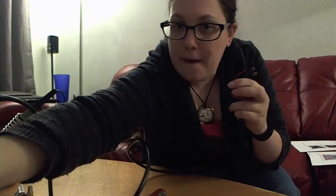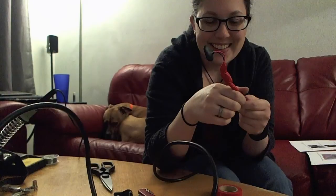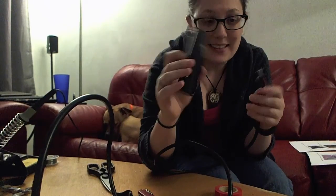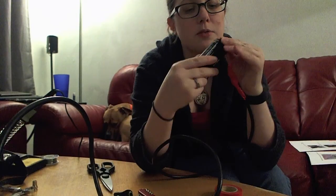Next you want to protect all of this exposed metal. If you've put a heat shrink wrap on, you would shrink that now. Because this RF choke is really big, I'd just use some electrical tape to go all around it. This big old mess here is your power connector. Your power supply is your 8 AA batteries in a battery case, and you can use the 9-volt connector to connect to that, just the way you would a regular 9-volt battery.